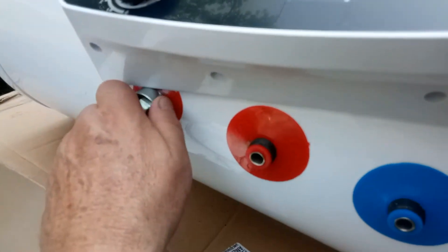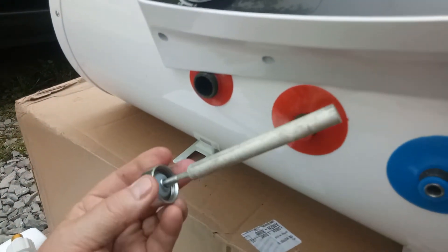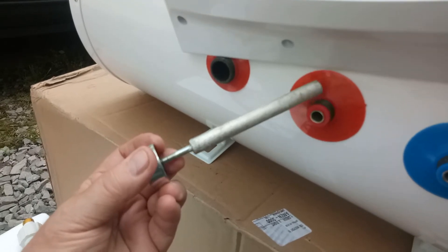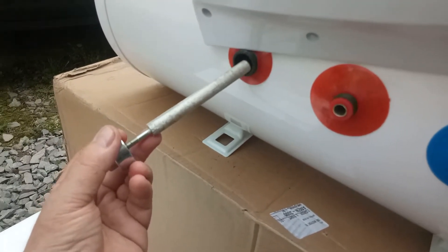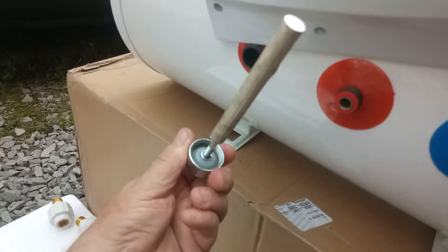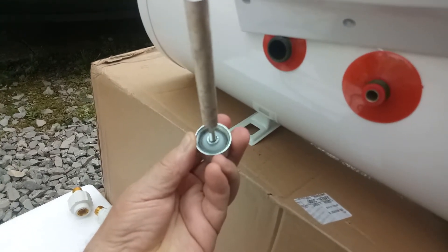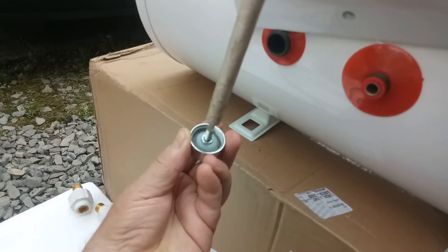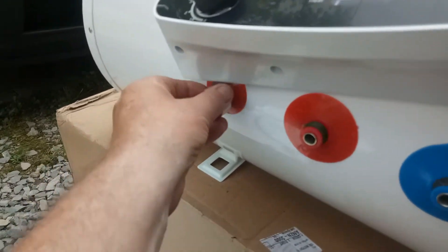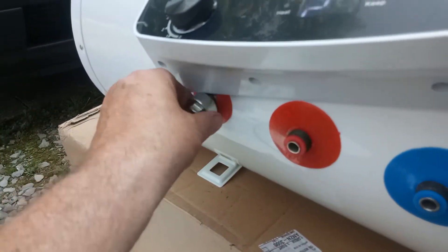As for the ports on the bottom, this is the anode — some kind of anode that goes into a bar. I can just see this rusting through and falling off. You should take this off and cover the threads with pipe dope. They're using this little plastic piece as a seal on the bottom, but without something on the threads to stop them from rusting, it won't be easy to get off each year. This is also where you're supposed to drain it.